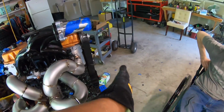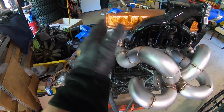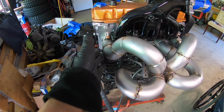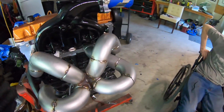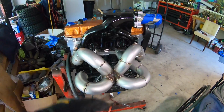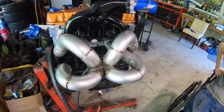So we have plenty of room in the front here for turbo stuff, but obviously there's going to be a transmission, bell housing, and so on. So we really don't want anything protruding past the rear of the engine. And like I said, this thing's what, 16 inches long total? So there's plenty of room forward. Well, it's replacing an inline 6. Right, a 4-liter inline 6.